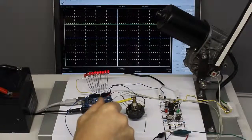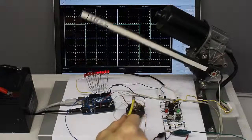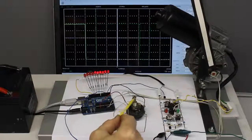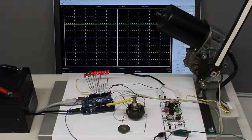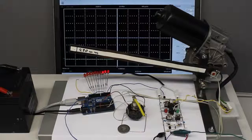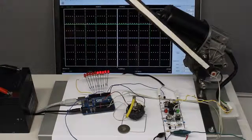As you can see, the proportional controller is a clear improvement of the wiper servo. The voltage interval in which the motor is turned off can be reduced, thus the precision of movement is increasing enormously. The servo speed is at its maximum whenever the duty cycle reaches 100%, forwarding 12V to the wiper motor. A disadvantage of this control circuit is the low power delivered to the servo motor whenever there is just a slight difference between set point and sensor reading. The torque is low near the set point, thus I can stop the servo easily.